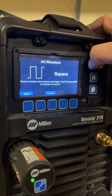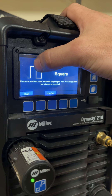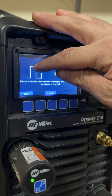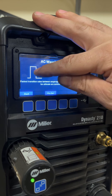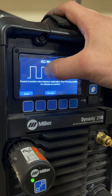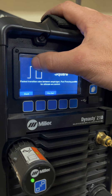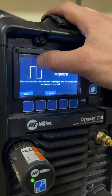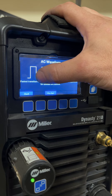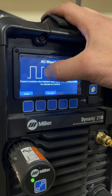To understand what's really going on here, it's very simple — look at this as just heat. As the wave comes up here, it's outputting heat or amperage; comes down here, heat, amperage. The area in the middle is outputting essentially no heat. You can tell that square wave spends a lot of time outputting a very consistent amount of amperage, and then immediately switches over and outputs a consistent amount of amperage on the other side. So the heat input of this wave shape is fairly high.